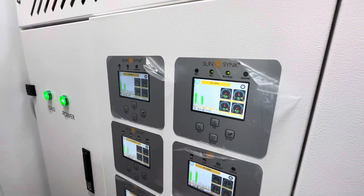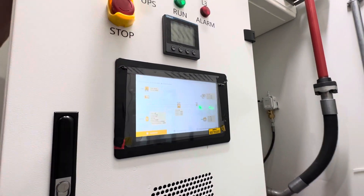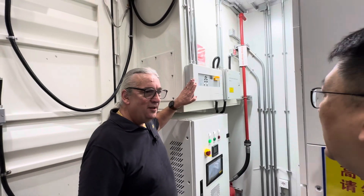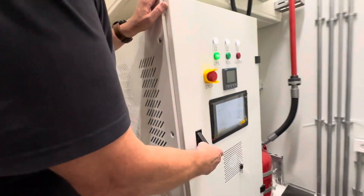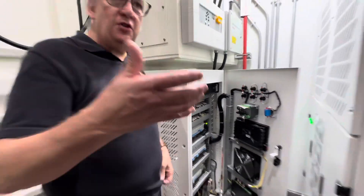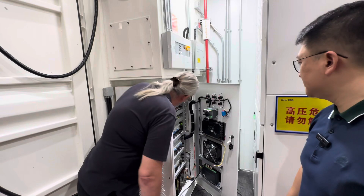Come on in Eric, explain a bit more. This is where we have the EMMS inside — you can control and display for the battery and the grid. Here is the fire suppression system. This one is for the ventilation control, and this is the gas detection. Then if you look in here, this is the switch box. We've also got a UPS here — for a cold start, if the batteries are too low to start up, the UPS will power up the system.